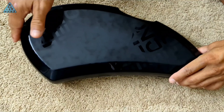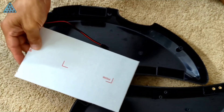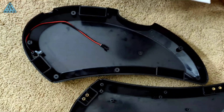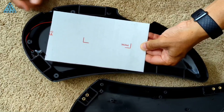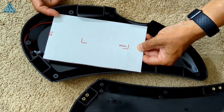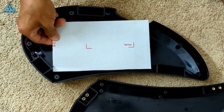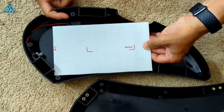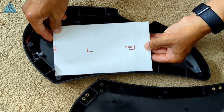I recorded this clip before the battery was delivered to help me get an idea of how the new battery might fit into the compartment. I cut an 8 and a quarter inch by 4 and 3 quarter inch cardboard template to see how to best position the new larger battery. The only critical requirement is that I leave room for wiring that leads to the charge controller. My pointer finger represents where wires will enter the compartment. Other than that, it's just a matter of determining the least obstructive orientation to mount the battery. Even though I wanted to avoid this, it looks like my only option will be to cut away some of the compartment to provide enough space for the battery and wiring to fit within it.